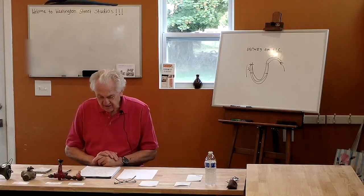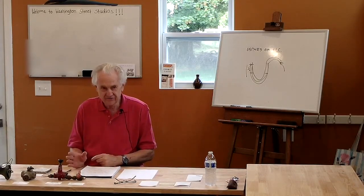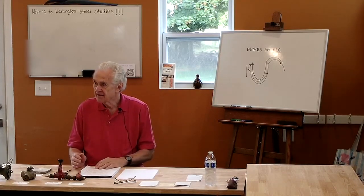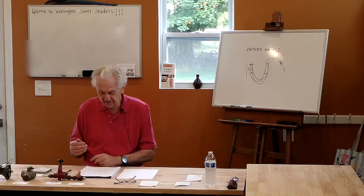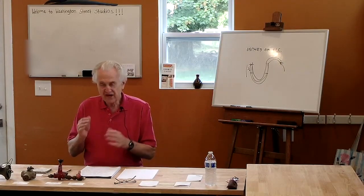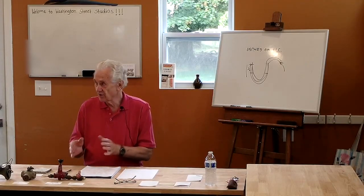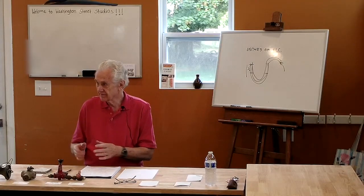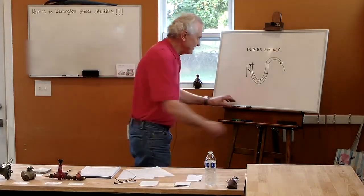There's another factor here. It's said that propane gas burns a lot hotter than natural gas. That's not true. That's a myth. It burns slightly hotter than natural gas, but the reason people got that impression, or came to that conclusion, is that the same quantity of propane gas yields a lot more heat than the same quantity of methane. And if you go back to the chemistry, it's easy to explain.